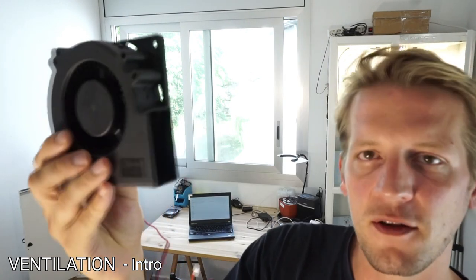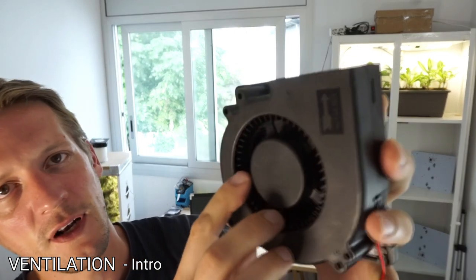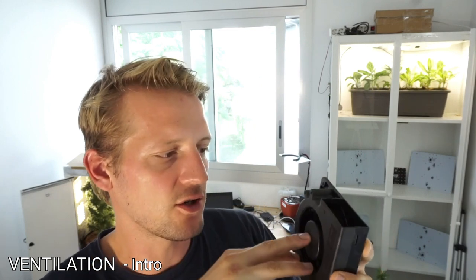Now the other most important part of the job is to set up a good ventilation. This will ensure temperature and humidity control. Ventilation also has an important role when it comes to controlling the smell by adding a carbon filter. That's why you want this type of ventilation when you want to add a carbon filter. Blowers like this are designed to work like a vacuum, while the usual fans are just made to move air. In the situation where you need to add a carbon filter, the blower will be able to cope with the obstruction made by the carbon filter by doing enough negative pressure to pull through it.